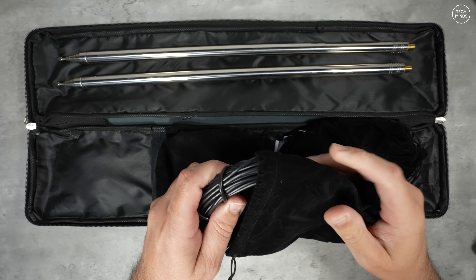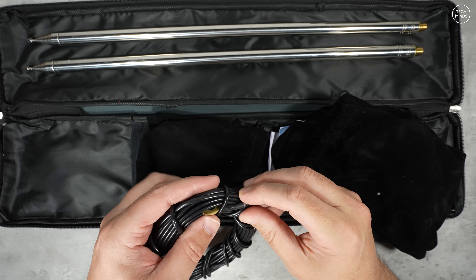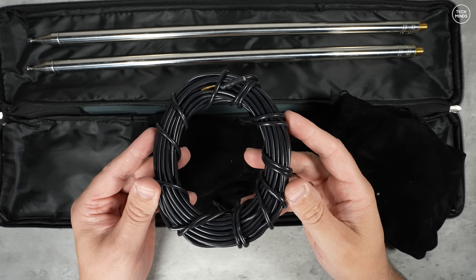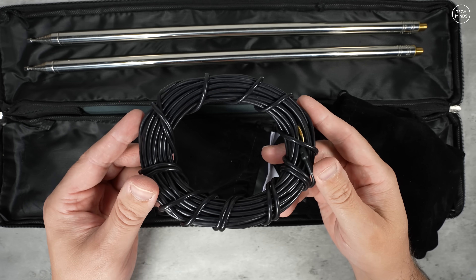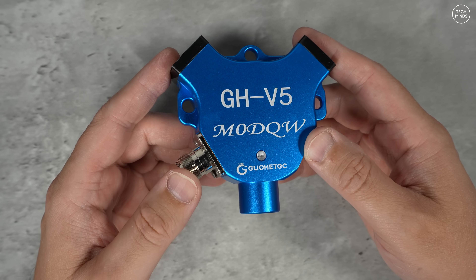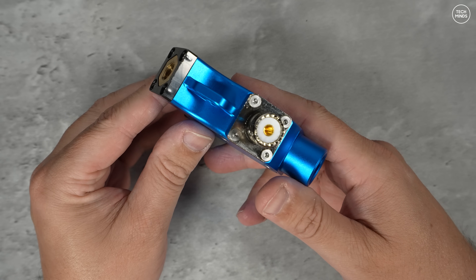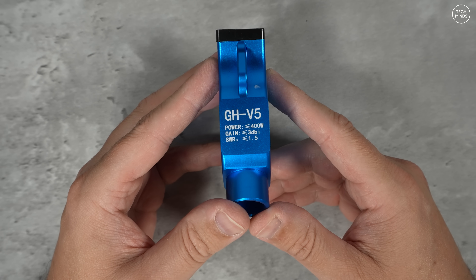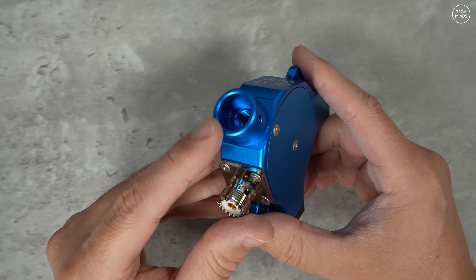As you can see, it comes in a carry case which makes it nice and easy for portable use. You also get two lengths of wire terminated with an O-ring on one end — these are used when operating on 40 meters or 7 MHz as an inverted V-dipole, and they're around 10 meters in length each. The main balun is nicely made with a really nice quality feel to it. When you order this antenna kit you can actually request your call sign to be printed onto it — which does look pretty if you like that sort of thing.